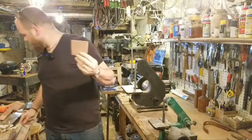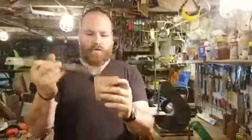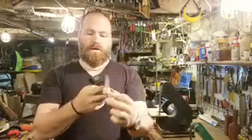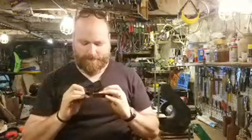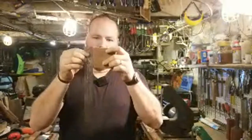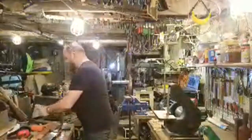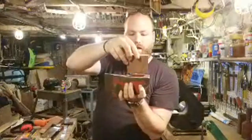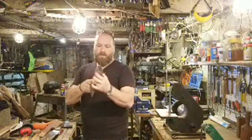So here's my wedge. We're more than thick enough. We've got 3¼ inches across the top, and just over 3 inches, maybe 3⅛, deep. So that should be plenty. It's obviously wider than the eye now, so we're going to go ahead and measure the eye.